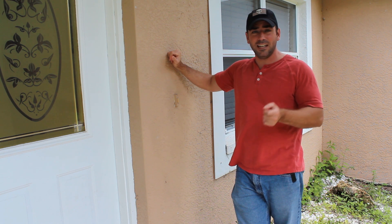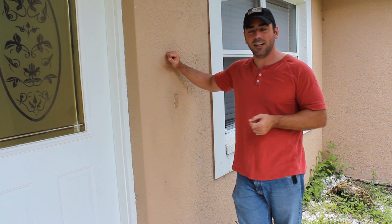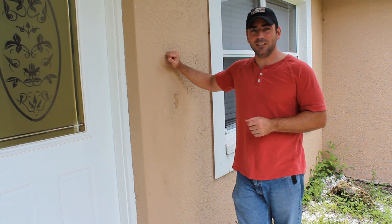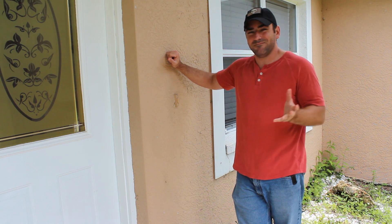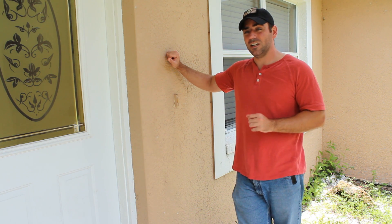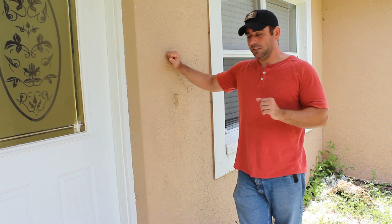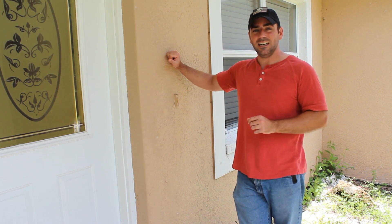Other options include adding a camera so you can see who's at the door, or using WebSockets which would give you an instant notification the second it's pressed, rather than the constant HTTP polling we did today which gives roughly a within-a-second notification. The approach we looked at today may not have been the absolute best, but it's a functional option. Using wget to constantly check is another option, though it might miss a button press. Going with a server-side script doing most of the work, with the client just checking the log for updates, would be a better long-term approach.